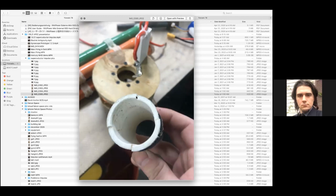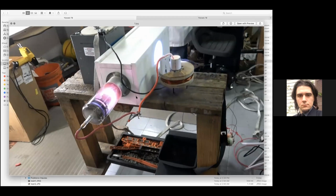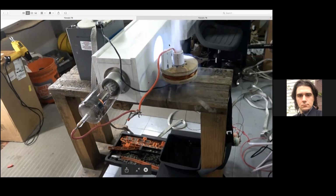Yeah, that's correct. In the next iteration of this experiment, a lot of things are going to change. First off, the entire assembly is going to be rebuilt with proper Josephson junctions, which we'll have to spend a lot of time building. We'll probably spend a good 2 days just making that junction correct because it's got to be so precise and so perfect, which means sanding the surface of the superconductors down to practically a polished finish and having them absolutely flat and parallel. And then finding a material that's already preformed that's going to give us the correct spacing. In fact, we may not actually need to bond it as long as we have enough pressure holding the stack together. That's how an SCR is assembled, and it works just fine. They're not bonded, they're just pressed together, and they have to operate under pressure. So that's the first thing. The second thing is, the water tray cannot be on the same mechanical assembly as all those moving parts.